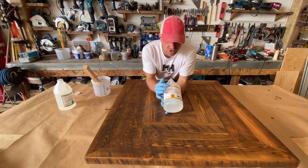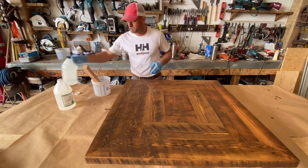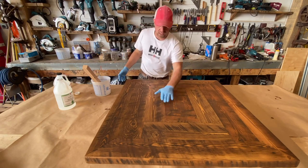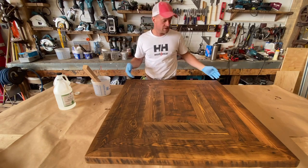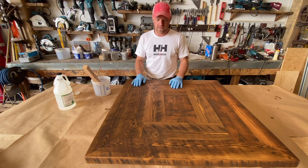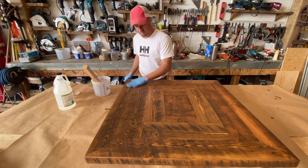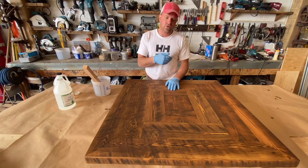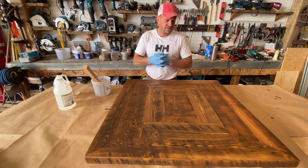This time I'm using East Coast Resin tabletop epoxy hardener. I got this off Amazon — I'll put a link in the description. I've tried quite a few of them; some are a little more fickle than others, and they're all kind of sloppy, messy, and temperamental, but they do have really good characteristics, so it's worth it. The first thing we want to do is a seal coat, then a flood coat afterwards — especially with barnwood because it's so porous and there are so many holes and cracks to fill.